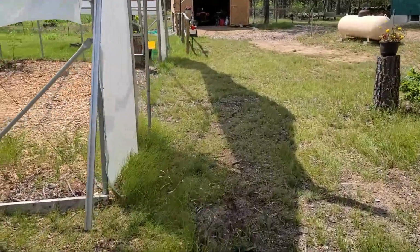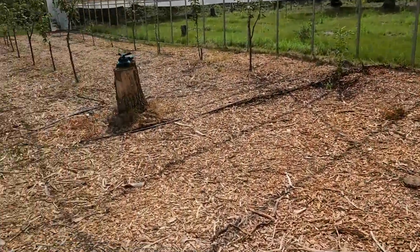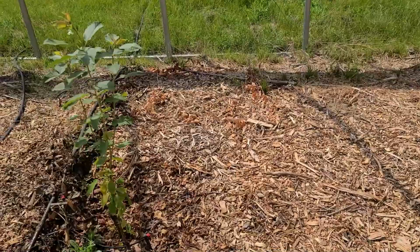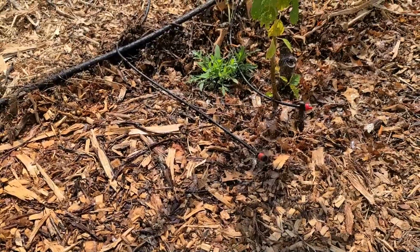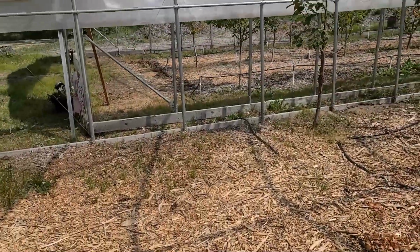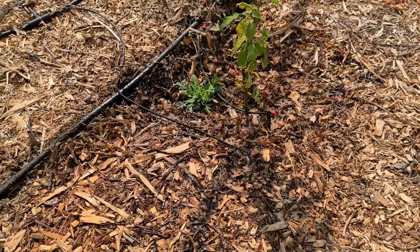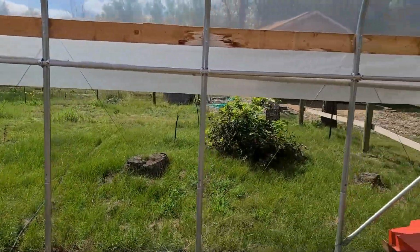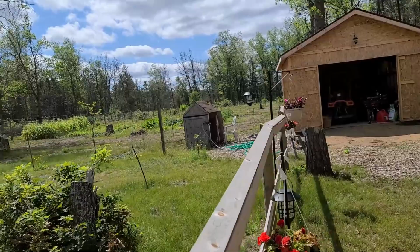I think high tunnel number 2 is still running, so I can show you what the drippers are supposed to do. That's why over there I don't get enough pressure to do it. But as you can see, I got it laying sideways. That dripper right there, see how it's sprinkling? It's supposed to emit about a 12-inch or so. Well, on the main line here going to high tunnel number 1, those drippers don't work that way. But you can see it's on the little hose, and it does. So somewhere, like I said, the same water pressure should be in both lines coming off the well, and it's not. So that's what I plan on doing today. Try to get this all nailed out.